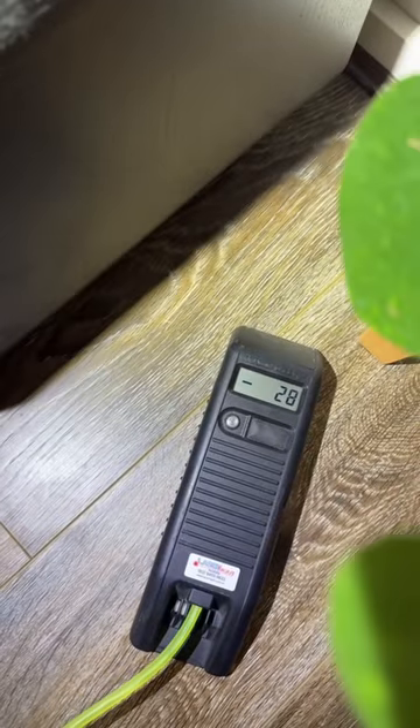Minus 28 — oh my god. The maximum tolerance within one area, let's say the kitchen area for example, is 10 mil. Here we have minus 29 mil. It can't be more than 20 mil throughout the whole building. This owner is still within the warranty period for floor levels, which is 24 months.